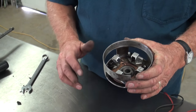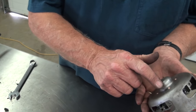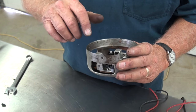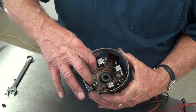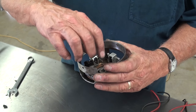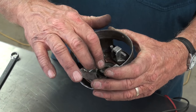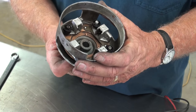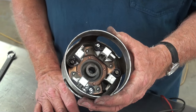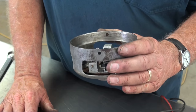The ones on the other side are grounded, so I think we're good on the insulators on the brushes — I don't think we'll need to change those. If one was grounded, we'd have to drill out four rivets, take the brush bracket out, drill out the rivets that hold the brush holder down, put a new insulator in, put new rivets in, and re-rivet back into the head of the starter. It's quite a chore, but generally those are not bad — they seem to hold up well.